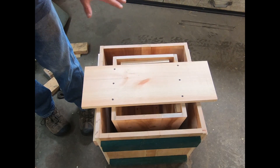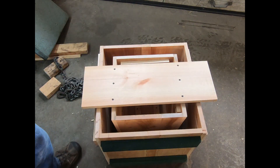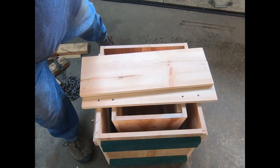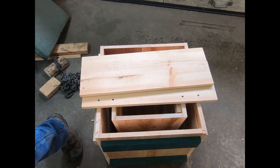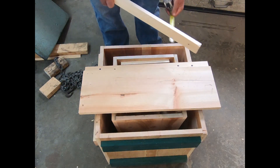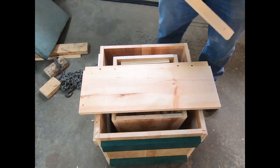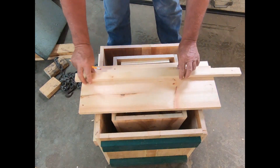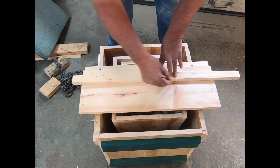I'll put the other pieces on and that'll make the form, then it's just flipped over and pour it. I'm not going to kill a lot of your time with it — I just thought you might want to see how I actually suspended it. Now I'm getting ready to put this one on. I measured out to the center line of that board — five inches — made a mark, and I'm gonna draw a line on it because I know I'll miss more times if I don't have a line to go by.